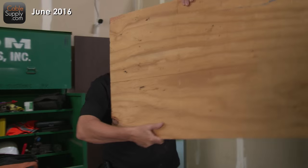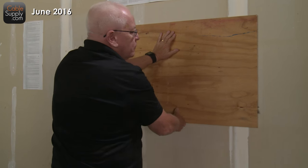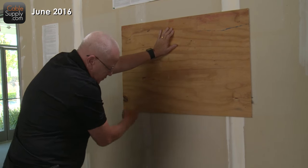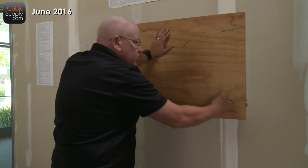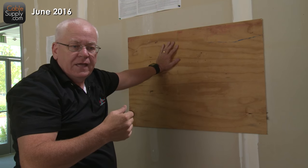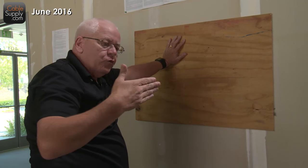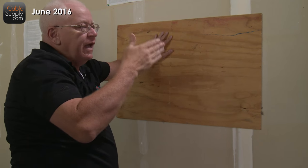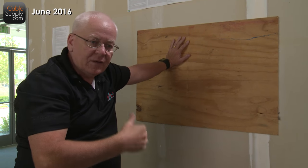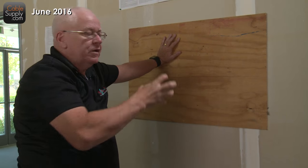What we're going to do is put this up on the wall and mount this first on the wall. The reason we're going to mount it is if you look, we can actually see on this unfinished wall — and of course there are stud finders — but you can actually see the studs here that are holding up the drywall. We're going to attach to two studs. This is what's going to be our support. When we bolt that data cabinet to it, it's going to be actually attached to the studs, not to the drywall. It's going to go through the drywall to attach to the studs, and then the data cabinet is going to attach to the wood backboard. The back of the data cabinet is open, and the nice thing about that is you can attach things through the data cabinet and it will be in a secure environment, securely attached to the wall.